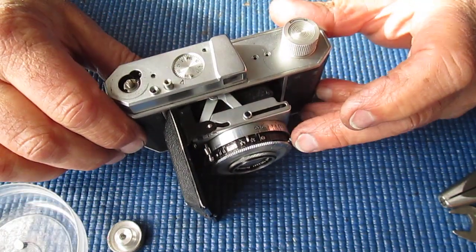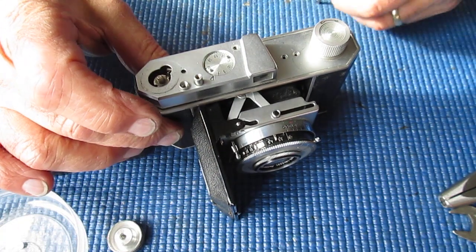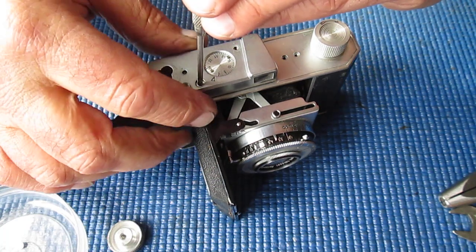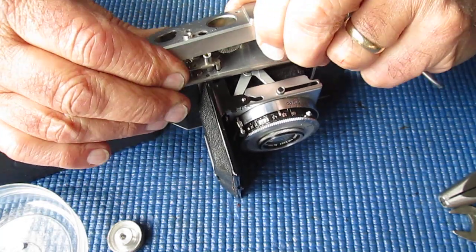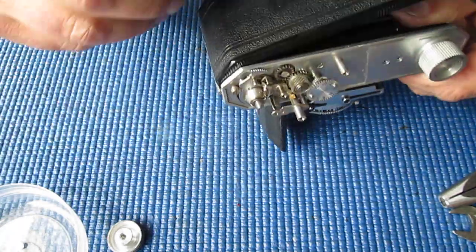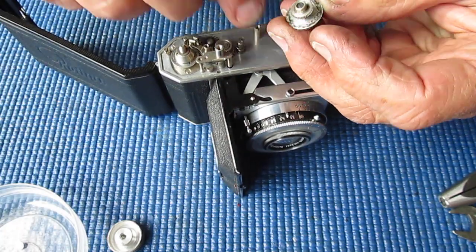Yeah. I cock the shutter, wind the sprocket forward with my thumb so that it's cocked. Depress the shutter down as far as it will go, and I should be able to lift the top plate, top cover back off it. Here we have it. All you have to do is get it off past the rewind button on the back. Alright, there's our frame counter